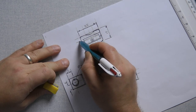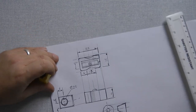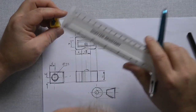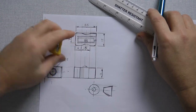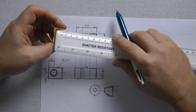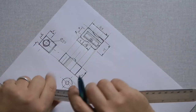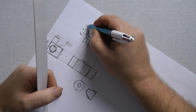The last bit I'm going to do is indicate the rectangle spacing here — I've got the width already. I'm not going to show the blade dimensions because of how the drawing is set up. I need to know where that rectangle comes: it's not centred, so I'm going to measure it off the bottom — 2 millimetres — and on the right-hand side it's 4 millimetres. I'll just show a couple of little dimension lines to indicate those key dimensions.